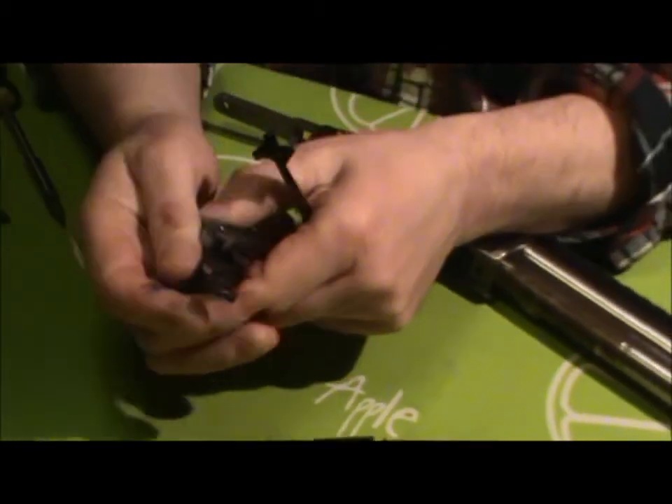If you buy the springs to smooth out a Marlin, you get the hammer spring and the spring for this little sucker — to lock it up. That's everything. If we could have something that smoothed out this one, if it's a problem, there is a spring inside. If I cut a coil of this spring, it will go smoother. But this is a press fit — I know I can fix that, cut a coil, but I haven't done that. No one mentioned it, no one told me ever to do it.